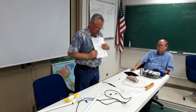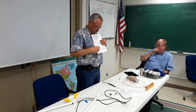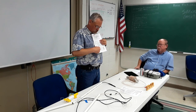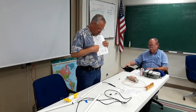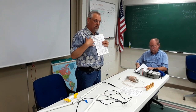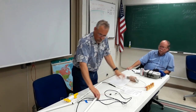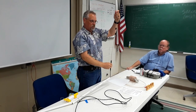Now, you've got that quarter wavelength, you measure out three of those, because you've got a quarter wave, that makes your half wave, then a quarter wave tuning. Then you adjust this part here. Now, how do you tune it? This is the part that I struggled with for a long time. John, you probably can give me some suggestions on this, but what I found worked is I leave this three-quarter wavelengths long. That's this whole piece here.